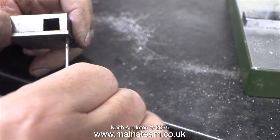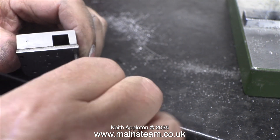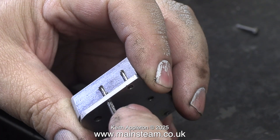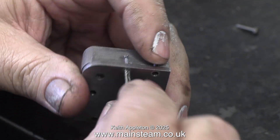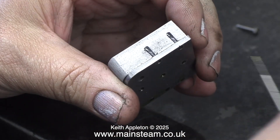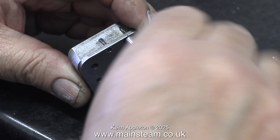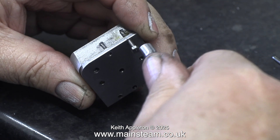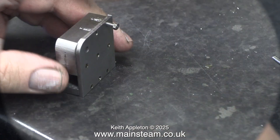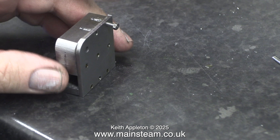This clip clearly illustrates that the block is too small for the cover plate. And after drilling the holes, I can clearly see the impression of the thread on the outside. And at this side, the top is far too big for the block. Okay, so this is underneath — I could use some JB Weld and bodge it, but I'm not going to do that. If a job's worth doing, it's worth doing well. Surprisingly, the 6BA bolts fitted perfectly into these damaged holes, but that's not the point. I cannot live with a job like this at all. The holes are very close to the edge on the top cover plates, and having the block too small was never going to end well.